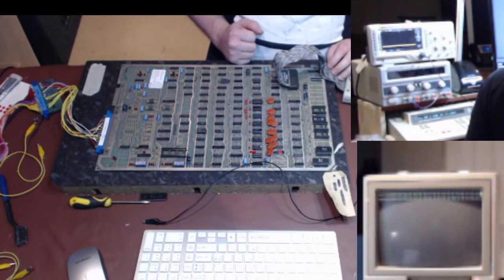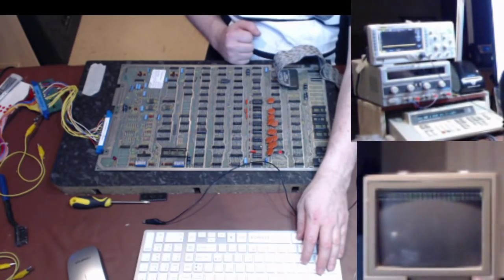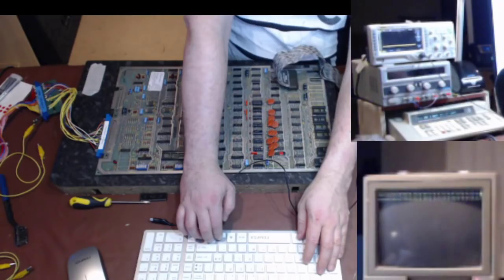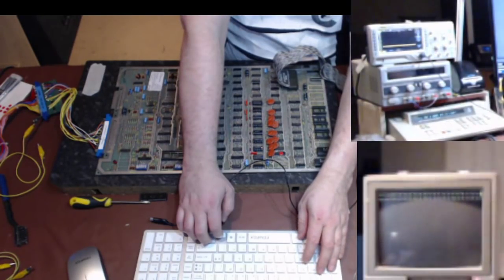And we'll come back to that in a minute, because I don't think that's through the E2 one, or is it? Is that through E2? It could be, actually. I have a feeling it actually is through E2. It wouldn't surprise me if E2 marshalled. Where does that actually go to? So that's to BD765432, blah, blah, blah, to sheet 2, side A, sheet 2, side B. So it's wherever those two go to. I have a feeling they go to the RAM.